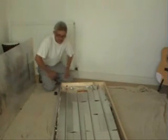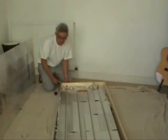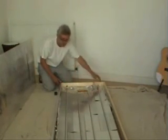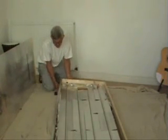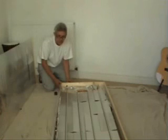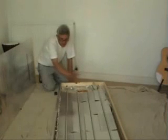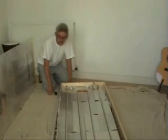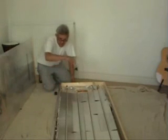It's really quite straightforward, and just to give you an idea of all it is, first of all we build this wooden box which is about 2.4 metres long by 0.7 of a metre wide and about 15 centimetres deep. On the back of that we've screwed a sheet of plywood which will go against the roof itself, and then inside the box we've soldered together 4 lengths of copper pipe into an S shape, so it's one continuous length joined with elbow joints soldered on at each end to create this S shape.